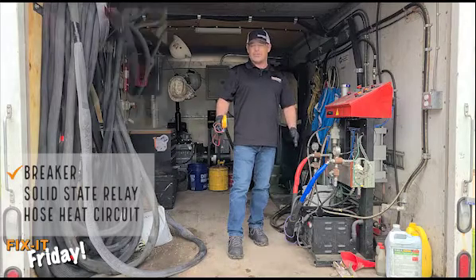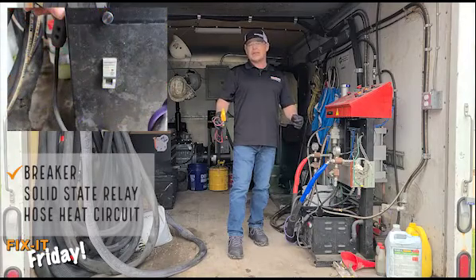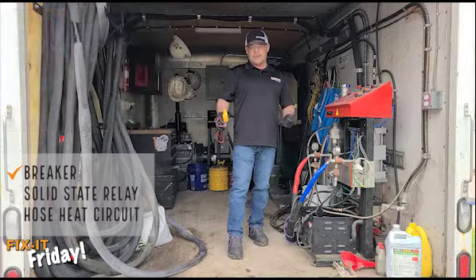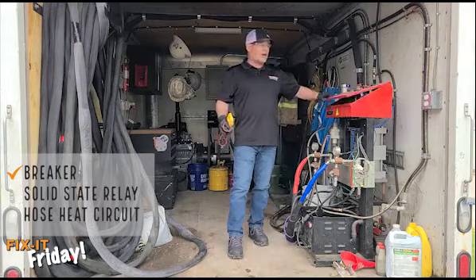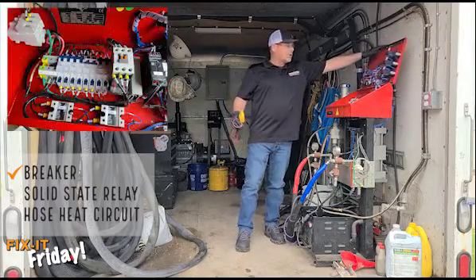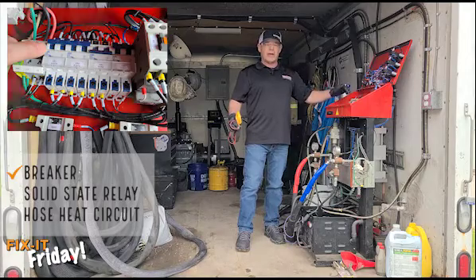The transformer console has a breaker on the face — it's an exterior breaker. If it's down, it should indicate that it's off on the switch; you'll want to turn that switch up. If it's in the console, undo the three screws on the front, open the console, and circuit breaker three is notated as the hose breaker. Just make sure that you turn that on.